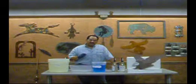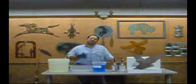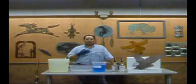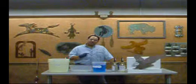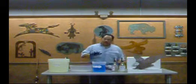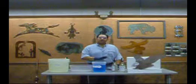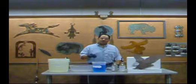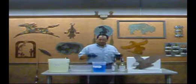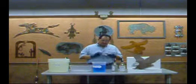One of the things we get asked all the time is if we have a finish that makes a bronze, chemical finish on steel. We don't have one. But if you use one of the combinations that we have in our chemical line, if you use the copper plate and the dark pewter together, it will give you a bronze finish. The more of the combination you make, the darker it's going to get. But let me show you how it's done.